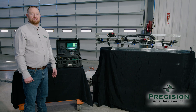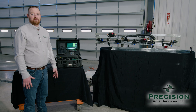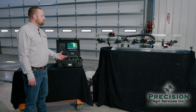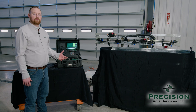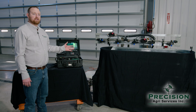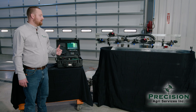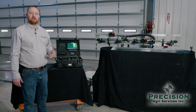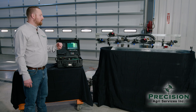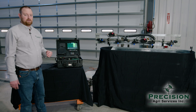Hi, I'm Justin Gubo with Precision Agri Services, and today we're going to talk about a product from Precision Planting called the Symphony Nozzle System. It is a PWM style nozzle control for sprayers to allow your sprayer to be an individual nozzle and rate controlled system with the pulsating nozzles. It is becoming a more common thing in the industry across other OEMs, and Precision has released their own form of that system.